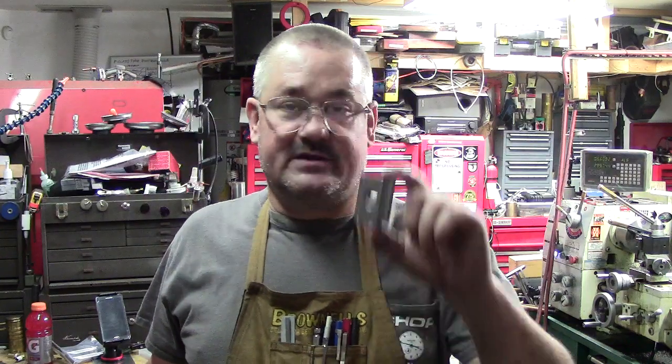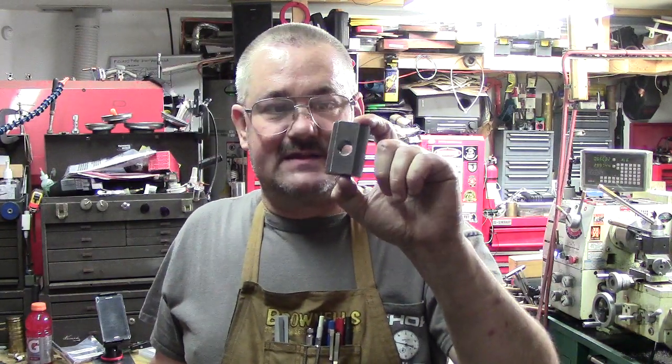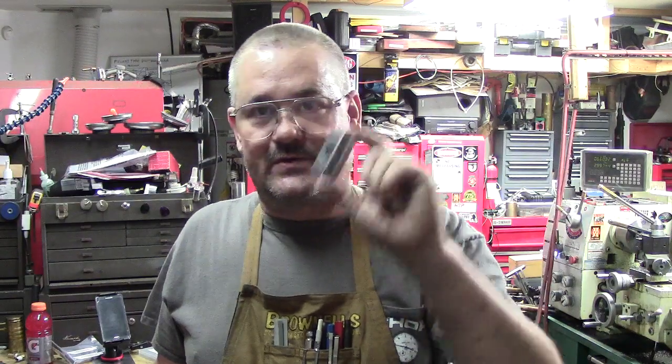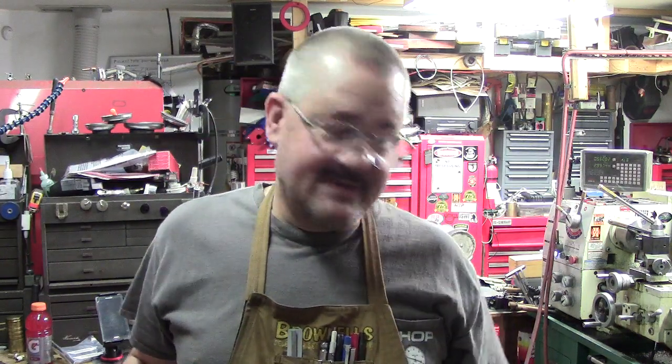So what I want to do, just as a me thing, is take and just throw a plug in there. I'll make one real quick out of some 1018 cold roll, throw it in there, run it through the heat treat process, and when I get done, I pull it out. That way I know the threads are good. I will run a tap through it just to make sure the threads are good to go. That's just something I've done. That was the way I was taught when you heat treat stuff, just to make sure your bolt holes hold